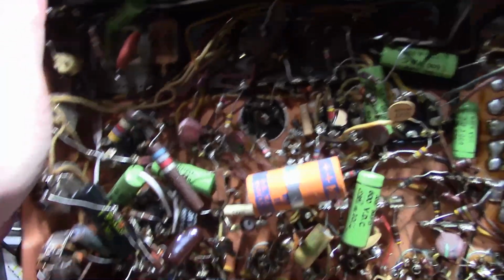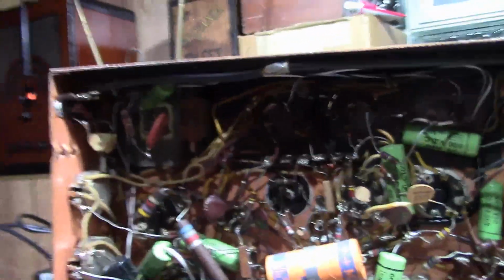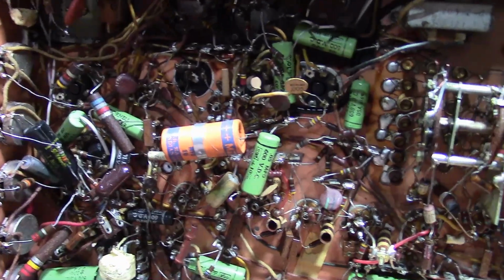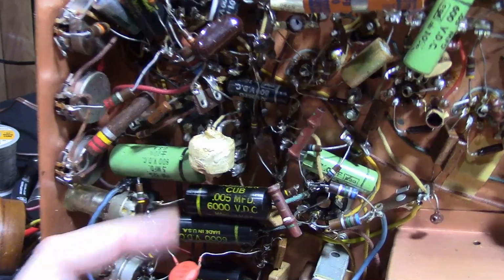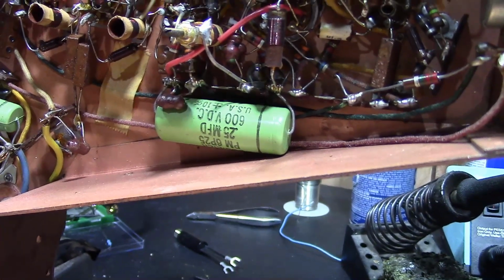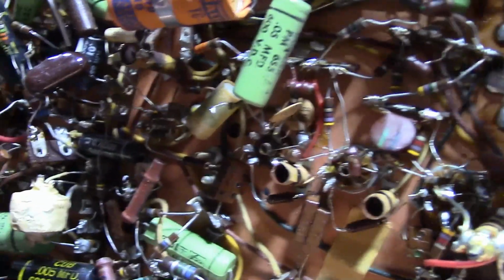And a curious thing, when I first reviewed this, I noticed that that modification isn't really going to anything, which made me think that they didn't finish doing whatever they were going to do. Which is odd, considering how much work they did here. So these are all replacements. Old replacements, and I don't know, these might be plastic film inside, they might be paper. I'll have to do some testing to find out, and maybe I can look up the parts. Like that is a 6P5, I believe. Or 6P25. PM6P25, that's what a lot of these are. PM6S5, well, I can look that up.